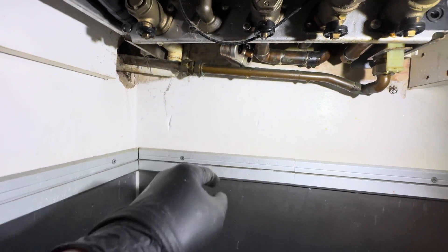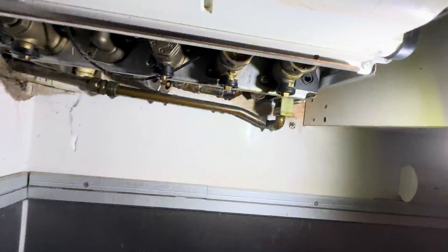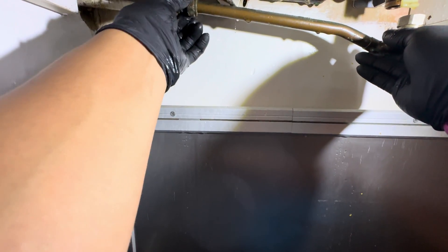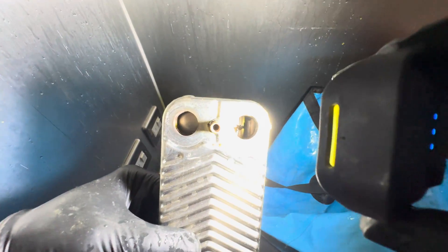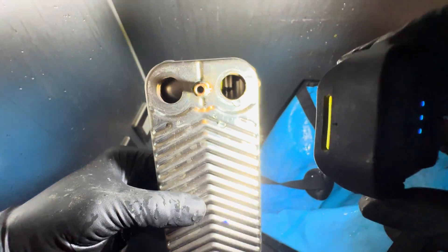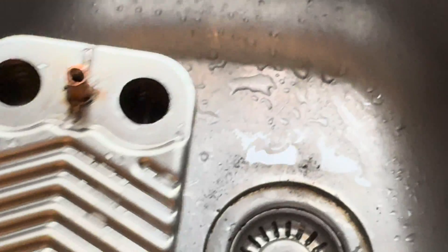Not my install. Let's disconnect this PRV and that should just drop out — and it did. There you go. Let's have a look inside it and see how much marks. Sometimes these get really blocked quite badly and still function; sometimes I've had them with barely anything in there and they're causing a massive problem. You change it or clean it out and it's fine.